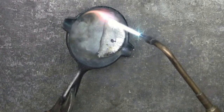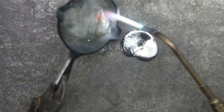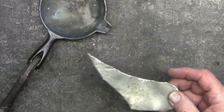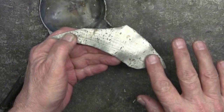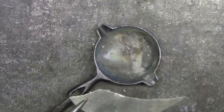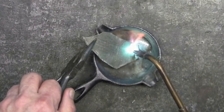It's just amazing to see it pour out in this liquid form — it opens up so many possibilities. This is the outside of the pewter; it was the outside of the pitcher, and it's pretty clean. But if I turn it over, I see some oxidization — probably oxidization combined with dirt. So when this melts, it's giving off some of the real pewter mixed with the oxidization and the dirt.